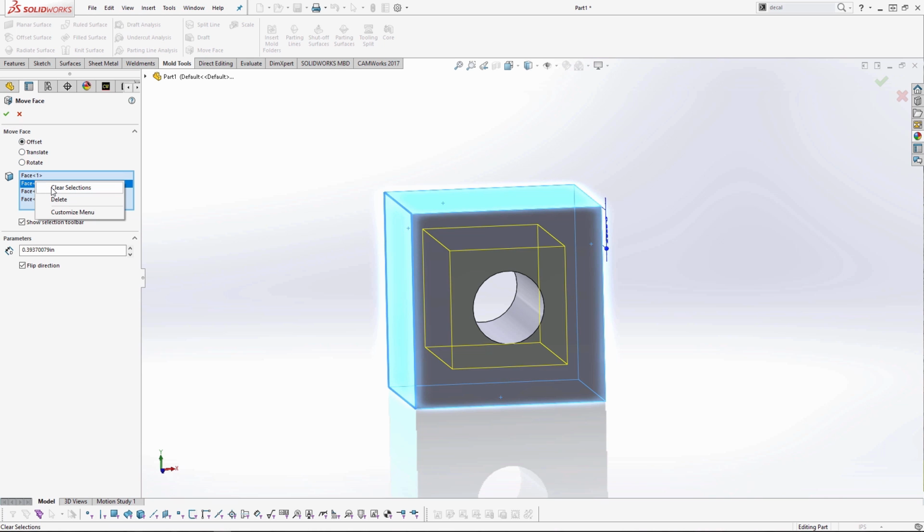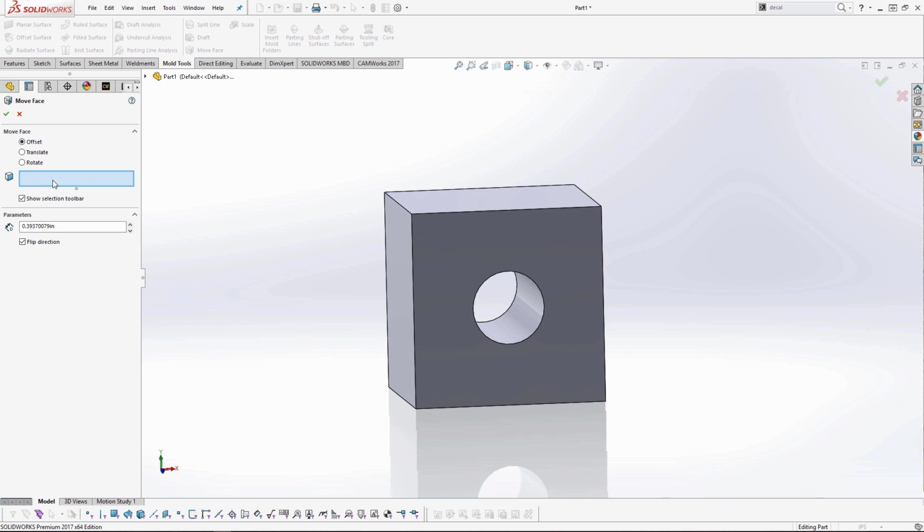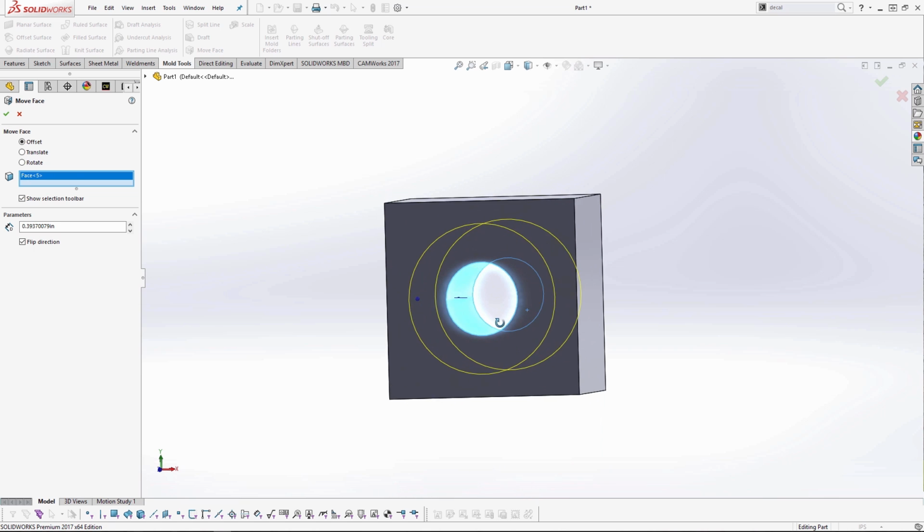Now this is commonly done on holes. When people create parts, say on this 36-inch part, they might have only designed 20 thousandths clearance between a shaft and a hole it's going through. But if I'm going to scale it down, in this case, this toy, I scaled down 12x, that 20 thousandths becomes something like 2 thousandths, right? So that's obviously not going to work. So I might scale a hole up or scale a shaft down by using this move face option.